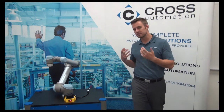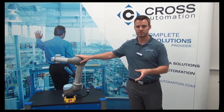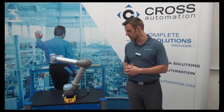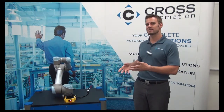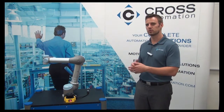As we step into the first zone, we trigger a reduced speed mode within the robot — and that is completely customizable. It could be a little faster or slower than this, and it could also be a reduced force mode. It really depends on what your application needs. What's happening is that the area scanner recognized that I was in the zone and sent a safety-rated output to the UR controller, triggering the reduced speed mode.